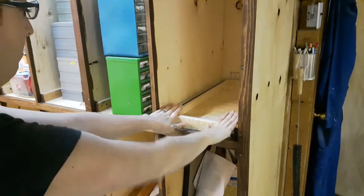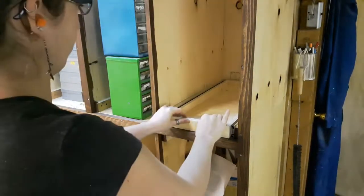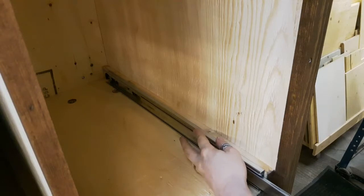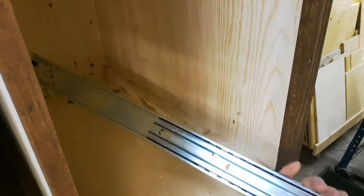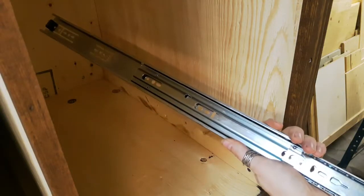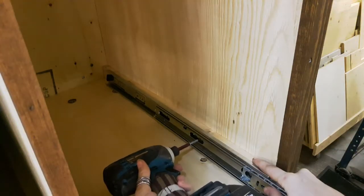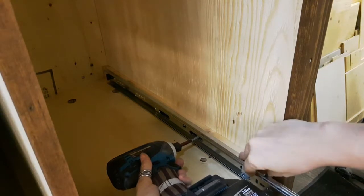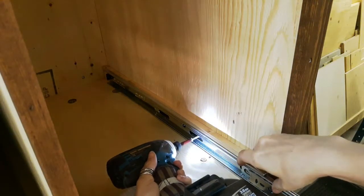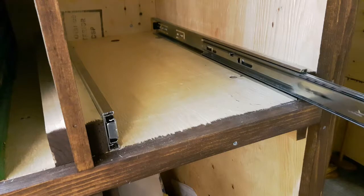And that is a beautiful fit. Now that the base of the drawer is all set up, it's time to install the sliders. And these are really easy. As you can see, there's nice little holes all the way along. You can slide the slider back and forth just to make sure you reveal them. But they've also got these little cutouts here, and that helps to take out any variation in the cabinet — pulling a little this way or pushing a little that way. They're so easy to install. All I had to do was lie directly on the bottom of the cabinet and make sure that the front was also lined up. And just like that, sliders are attached. And look how beautifully those slide.